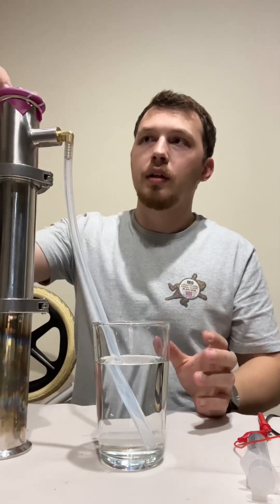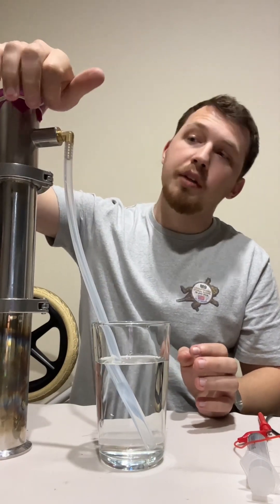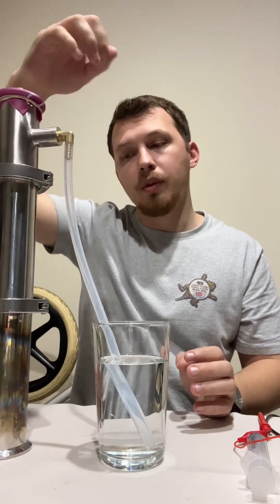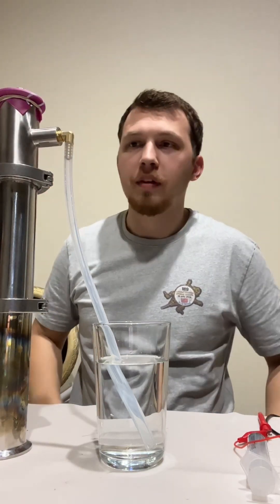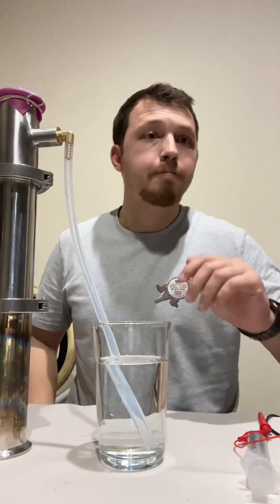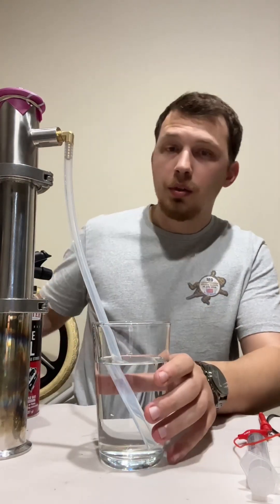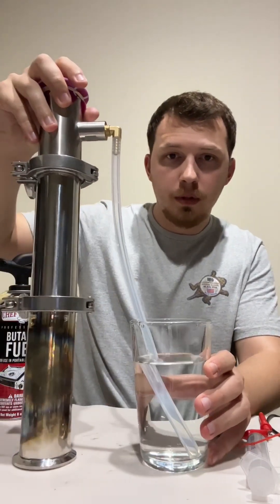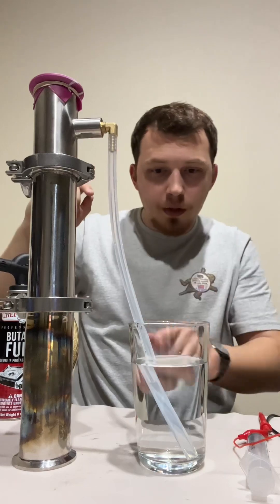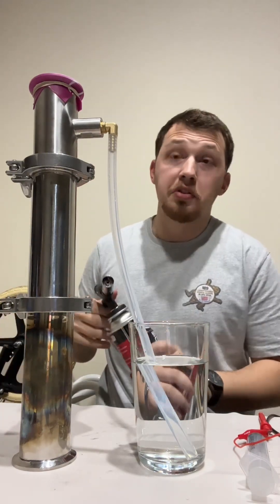I think the tube makes it more powerful and gives it a lot more thrust and reliability, because before I would run it I had to release some gas and so on — that's not a great option if you have to constantly monitor your engine. So let's heat it up and give it a try. As I heat this up with a blowtorch, you're going to see air bubbles come out of the tube, and the more air bubbles, the closer we are to running. It should just start by itself.